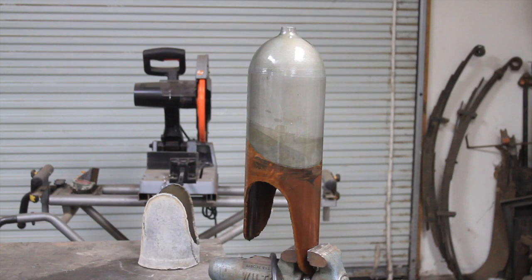It's been 24 hours since the bell has been in the acid. Obviously the bell didn't fit in the bucket completely submerged, so I had to flip it over halfway through — and that's why one side is kind of rusted already. But that's fine because we're going to be rusting it anyway, so it's just giving me a head start. Look how nice and clean it looks right after it comes out of the acid — nice and shiny, back down to the bare metal.